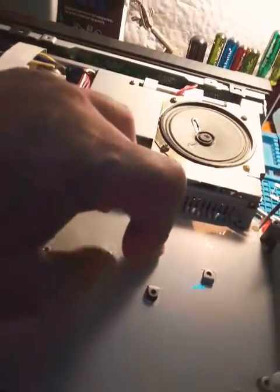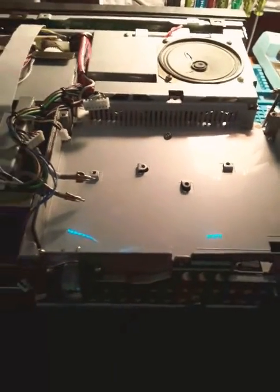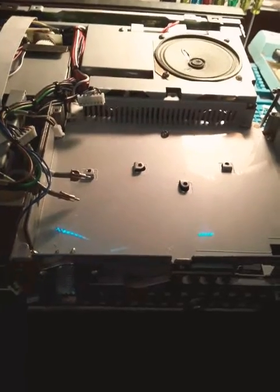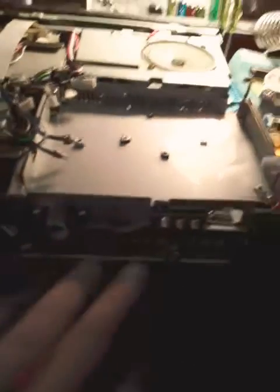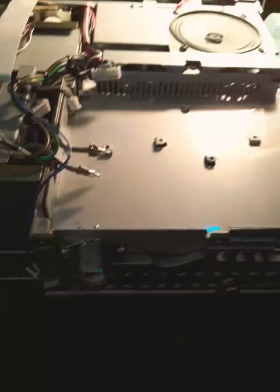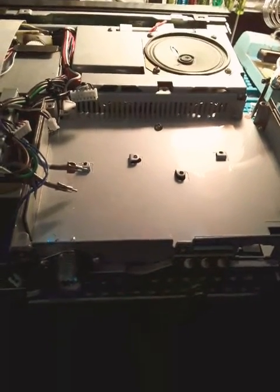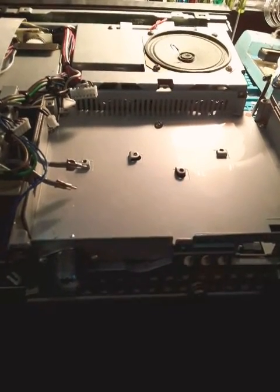That's what it looks like here. When you take this tray off, be careful — do not lose this plastic piece; it insulates in case something touches. This is where the filter board was. What happened was I lost power because I was tired and not feeling well, and I hooked it up backwards on my power supply. It did not smoke, didn't pop, didn't do anything. The only odor came from the back, right around this region. Chances are it's probably the voltage regulator blown. There's no power whatsoever going to it. I noticed the screen gets brighter — they say to replace all voltage regulators, as one of them could be leaking.